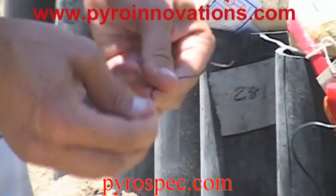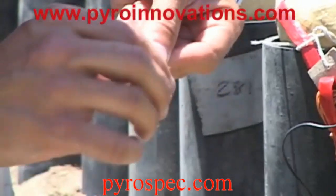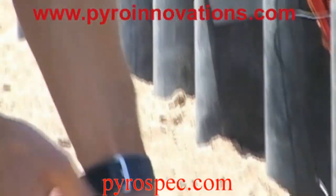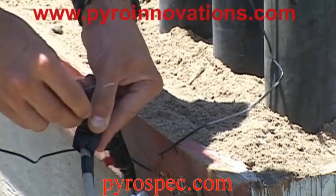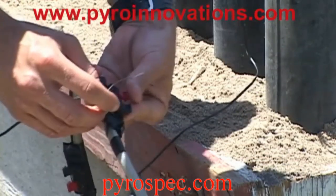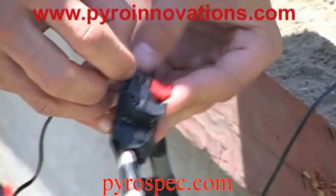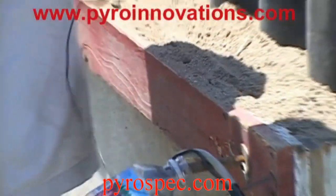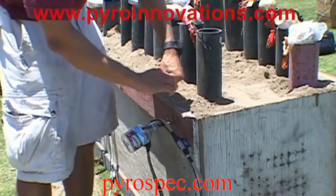Split it apart. You're going to do a little horseshoe bend — bend it this way to get more contact. Make sure you get metal on metal, and don't put it in so far that you're crimping the insulation. Metal on metal. Roll up the excess wire in your hand and twist.